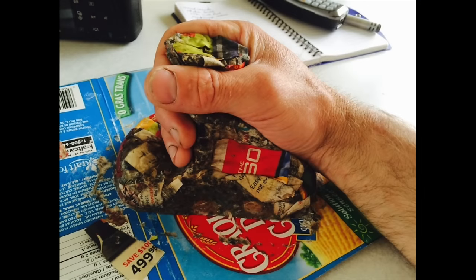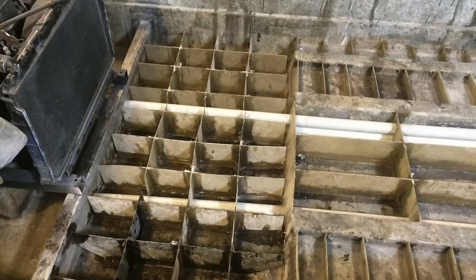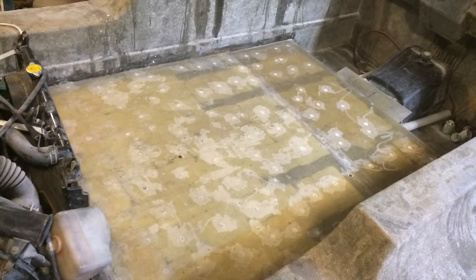What would be a hovercraft without a joystick? I wanted a joystick handle that custom fit my hand, so I used paper mache to get the shape right and then fiberglassed it. The hull bottom lacked rigidity, so I used my fiberglass panels to make box structures. I filled them with expandable foam and then sealed the top with a fiberglass sheet.